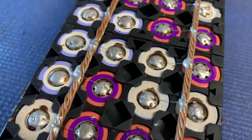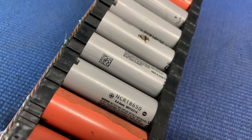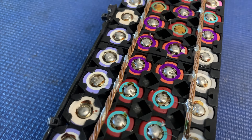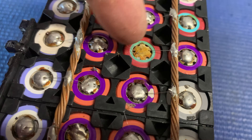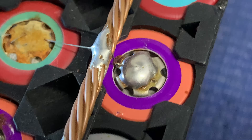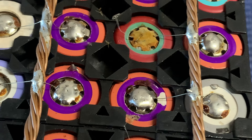The Sanyos are more typically related to the heaters. I've only ever had one Panasonic ICR 18650 cell actually go a heater — that's the only other one I've ever had go a heater. Now I did have a hot one the other day; it was up the top. I had to reach in and snip the cable — that one there, by the look of it. No, that one's still connected. I did disconnect one, but it should be a zero-volt cell. So let's have a look at that first.